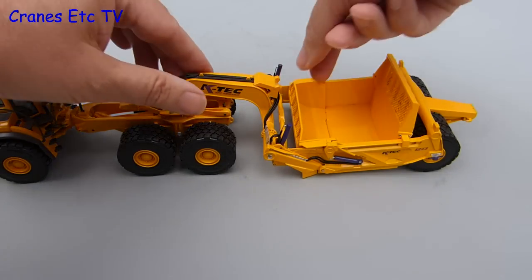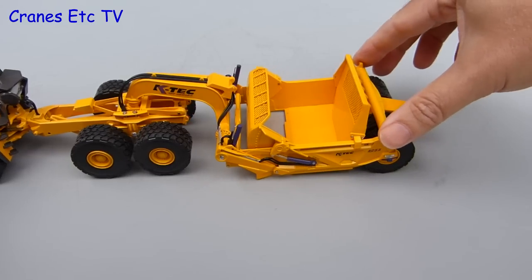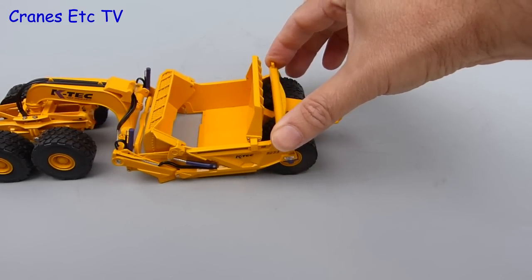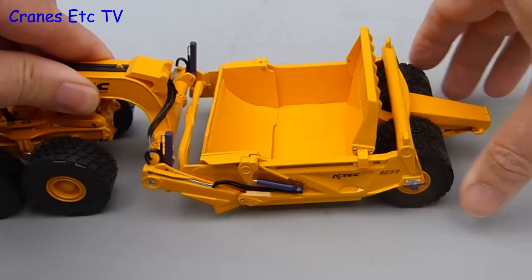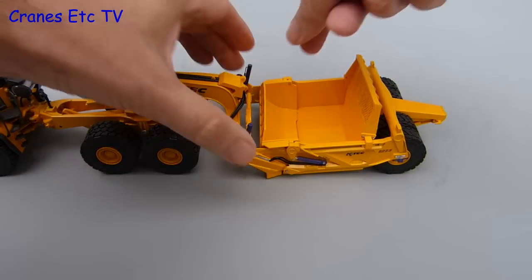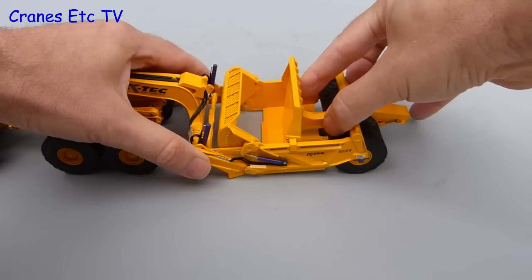However much better is the hydraulics that control the gate — it opens up fully and can hold the pose. With the gate up the scraper is towed along and it cuts the earth with the blades at the bottom of the bowl and fills it up. When the operator sees that the bowl is full he closes the gate. The bowl should be raised and then he can drive to the discharge point. Once he arrives he raises the gate and uses the ejector to push out the earth as he drives along.